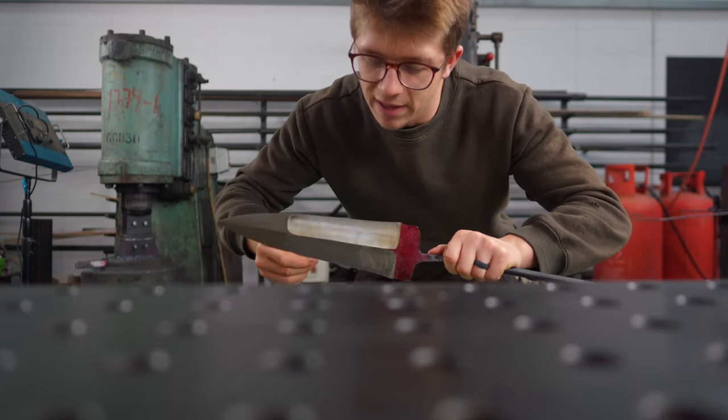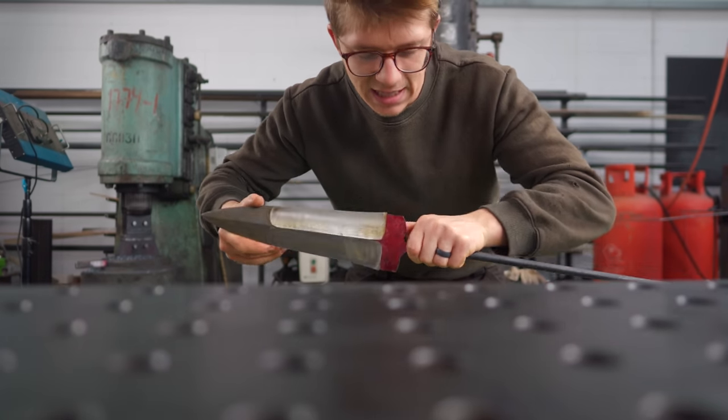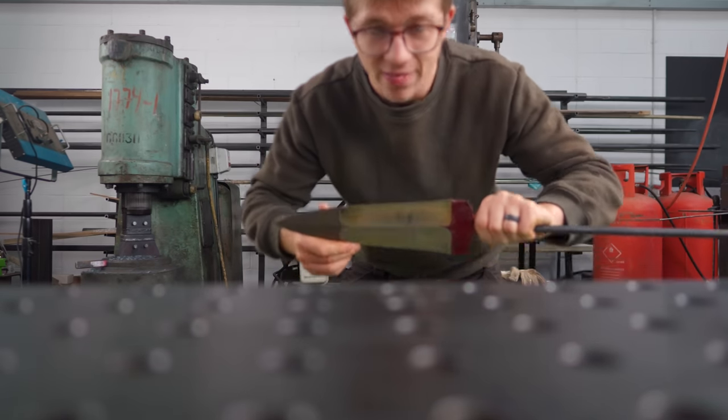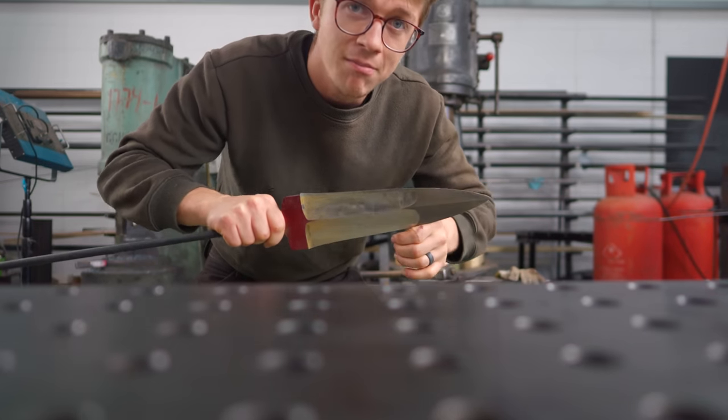I'm so much better at grinding like this, when my right hand is on the blade and I'm pulling across like that. That, for some reason, suits me so much more than grinding like this. I'm always much shakier on this side. My typical approach is to do my strong side first, which might not make sense, but it at least makes me feel better and get my confidence up. So I go strong side first, pull all my stuff across to my left, then I do my weak side bevels after that.